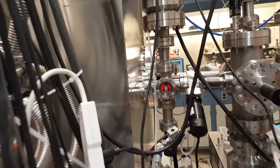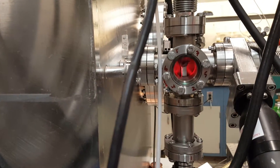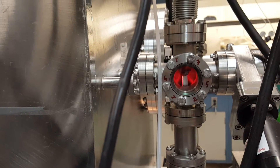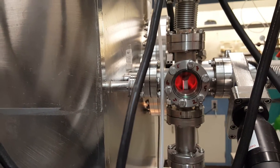You can see the final step before the light travels into the machine. It has a magnesium fluoride window that filters out the third harmonic 12 eV photons that we don't want in this particular experiment.